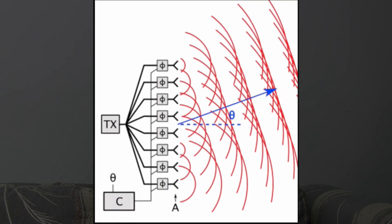In an electronically controlled array, the phase shift between the various radiating elements necessary to create the beam shape, rather than being controlled by the physical layout of the waveguide, are controlled by phase shift elements themselves that are associated with each of the antenna radiators. These can be done in one of two different ways: a passively scanned or actively scanned system. In both of these systems, because of the electronic steering used for the beam, there are a number of advantages over a mechanically scanned system.